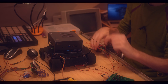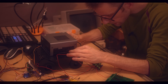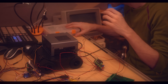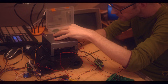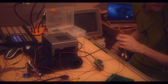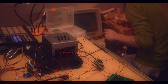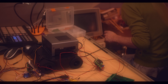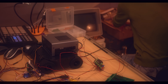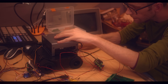The question is how do you want to set it up to drive it later in code? You can say the front left and the front right motor are motor one and two, and the other two are the others. That means when you're writing your code to turn, you would say: I want to turn motor one and motor three this way, and motor two and motor four the other way. You can also say motor one and two is left turn and motor three and four is right turn. I'm going to go with my initial instinct because I already wrote the code for it, which is already on this little thing.